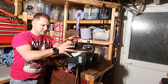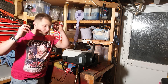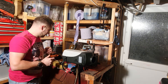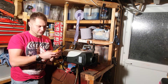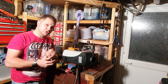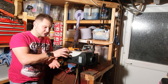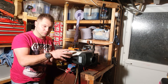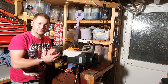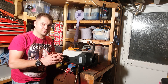Okay, so here we have it — this is a quick test on the diesel heater to see how many amps it pulls. I've got one of these amp meters, it's DC so it will work perfectly for this. It's going to tell us how many amps it uses on startup. This particular heater has a night setting, which is one of the few that does — it actually slows down the pump speed so it uses less fuel while still giving out a good amount of heat.